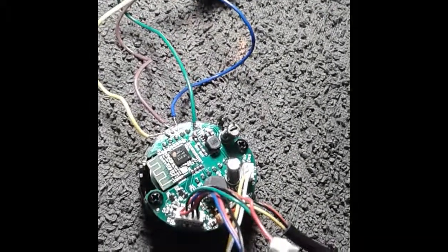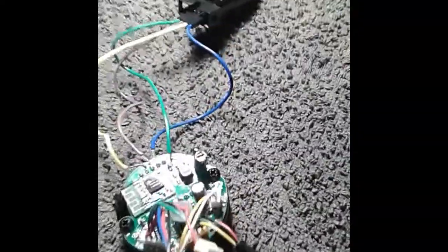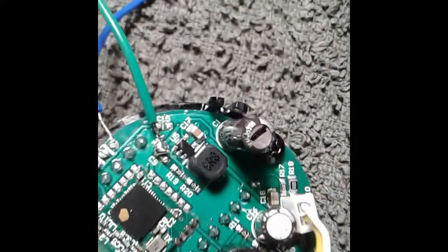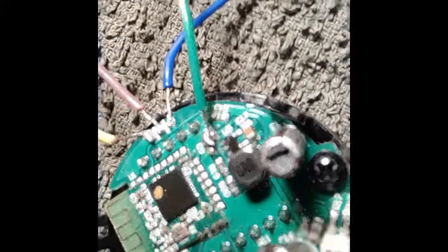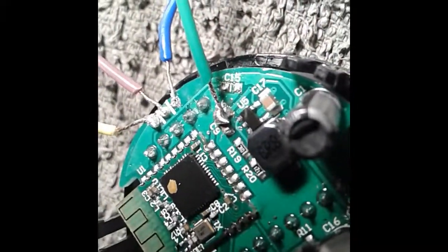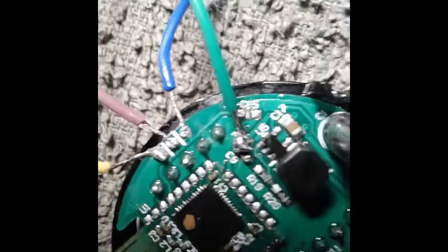I finished the solder. This is the dashboard that came in the Segway scooter and it's been locked down to only work with Bird. This little chip — the C15 — I burnt it right off because it blocks the Bluetooth from resetting the firmware. That was crazy, burning off a computer chip. Then I had to solder this one — it has a big glob on it — but it's touching one of the terminals on C17. I just had to solder it to one side.